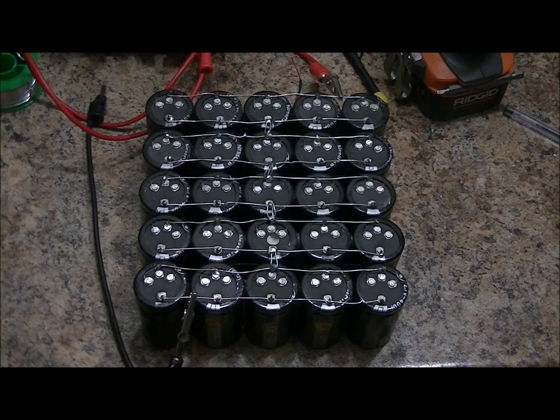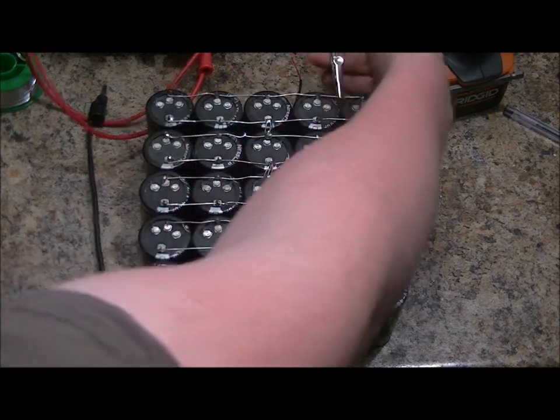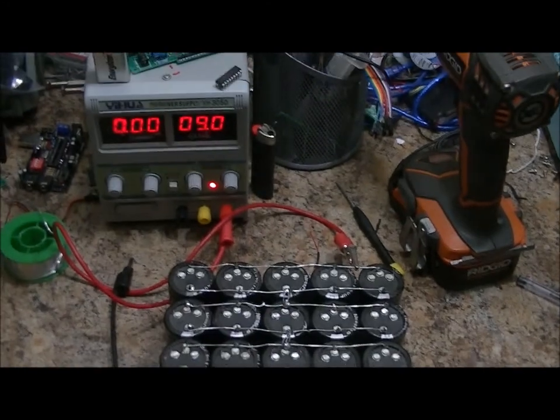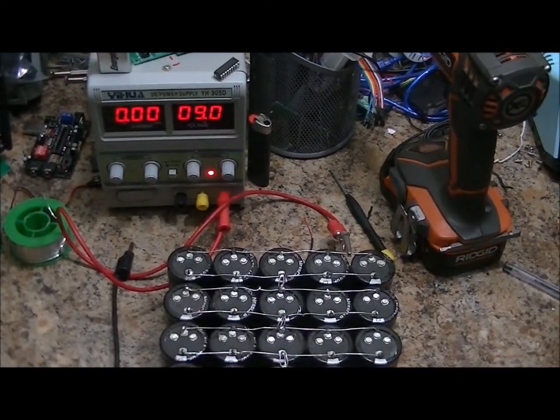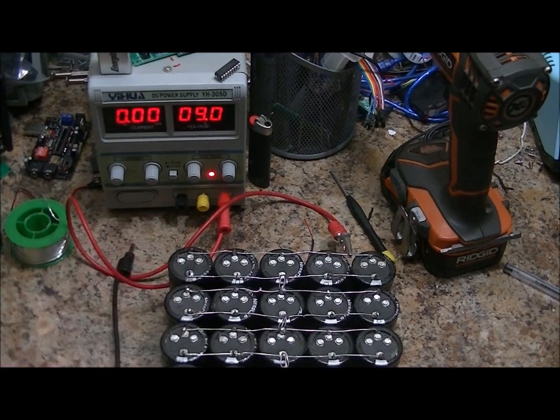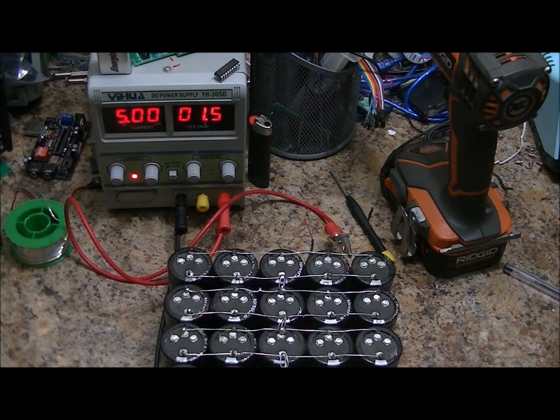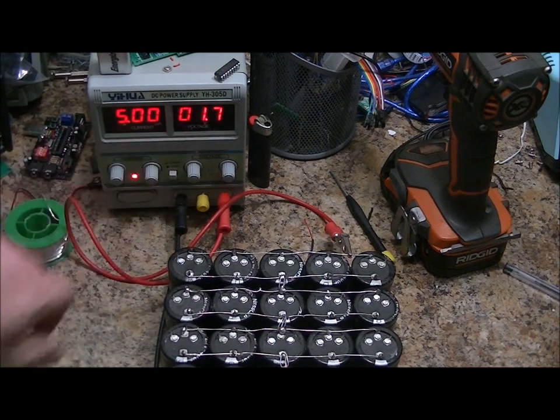It'll be interesting to see what I can do with this bank. I'm going to start charging it up. I've got my positive at the top connected to my power supply, set for 9 volts. It doesn't really matter at this point because it's going to sink down to whatever voltage is on the capacitor bank. I'll plug in my negative, and I'm currently sourcing 5 amps to it. As you can see, it was sitting at 9 volts and now it's dropped down to 1.7 volts, and it'll slowly start to charge.